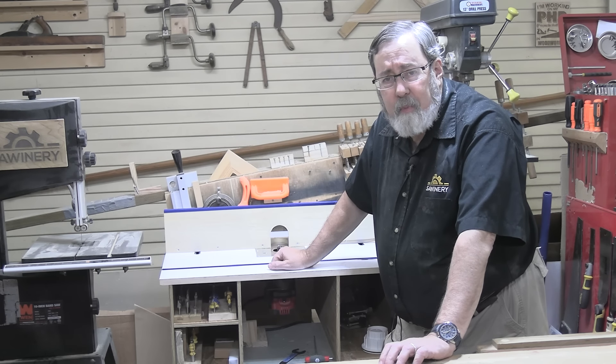Here's my finished router table. It's 32 inches wide by 24 inches deep. My fence can move way back and way forward on the tracks — it moves very smoothly. There are still things I could do to improve this: I don't have any real dust collection hooked up yet. This track is for putting a fingerboard on, these tracks here are for the fence to slide, and the track up here is for stop blocks or a featherboard. As you can see, I've got ample storage underneath — not fancy drawers, but I already have my bits all mounted in boards.